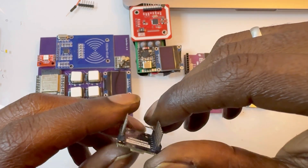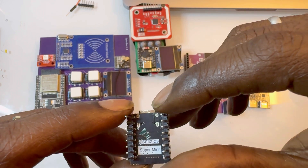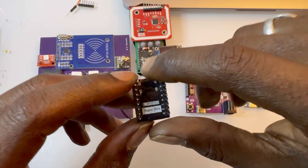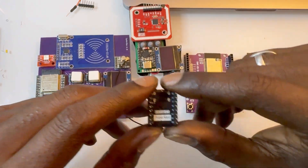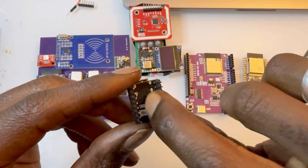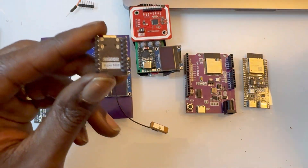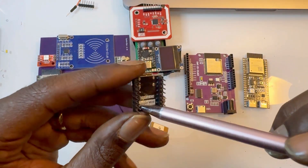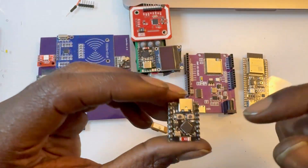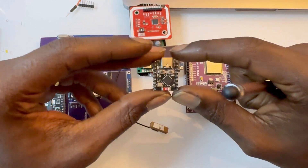It's nice that it is USB-C and it has just enough pins: one SPI bus, one I2C, one UART bus, 5V, ground, and 3V. The only thing is on the Xiao, they're about three times more because it's like two bucks. They do have a LiPo battery charger on the backside and a few other things. This is the basic version and it's four megabytes of flash — I think that's the most for these. So it's still super capable.